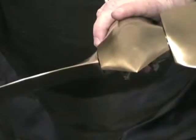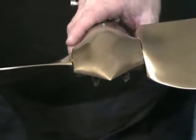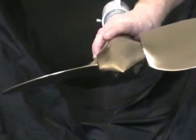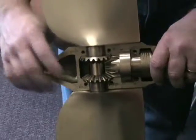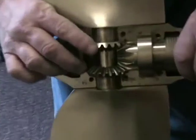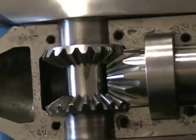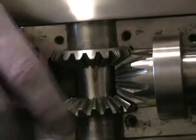As long as the half stays on top, the propeller will stay together, and then you can check to see what the letter settings are. As we can see in this example, the letter E on blade number one is going into the single drill mark on the cone gear.